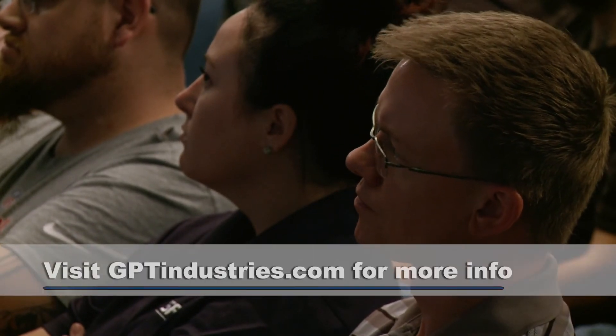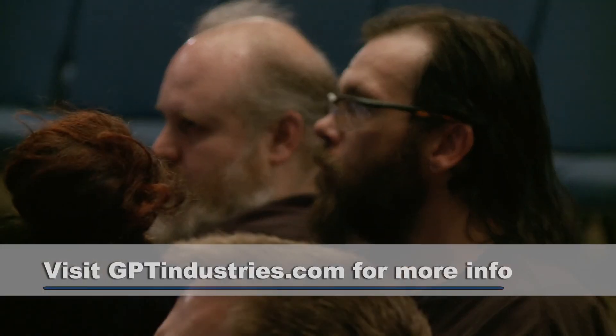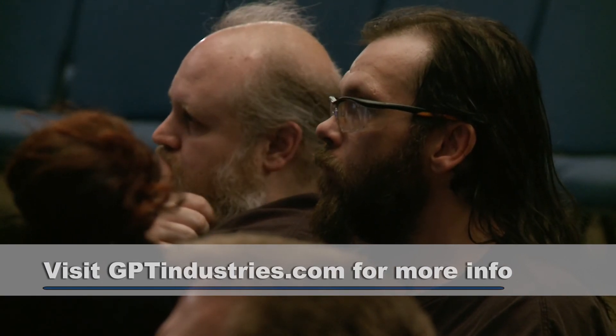If you want to download the paper 'In Defense of the MIJ' to get that assessment survey, you can go to www.gptindustries.com. Our final recommendation: personally visit the manufacturer. Ideally, bring a team that is knowledgeable on sourcing, welding, manufacturing, and quality control. Utilize the supplier assessment survey — it's simple to do and it's free. Insist on high-quality goods, manufacturing, and testing capabilities. If you do all of that, the results will be that you won't have the weak link in the pipeline — you're going to have the most reliable piece in your pipeline, and it will be your MIJ.